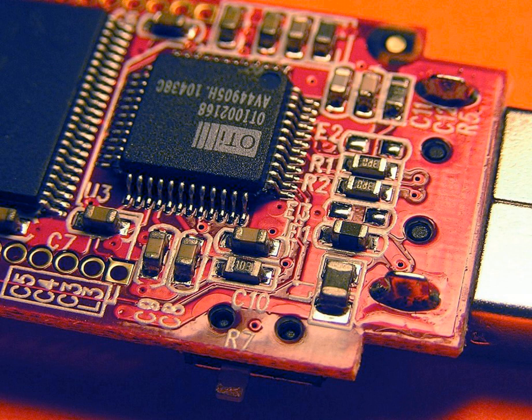After pasting, the boards then proceed to the pick-and-place machines, where they are placed on a conveyor belt. The components to be placed on the boards are usually delivered to the production line in either paper or plastic tapes wound on reels or plastic tubes. Some large integrated circuits are delivered in static-free trays.